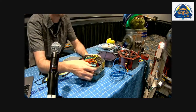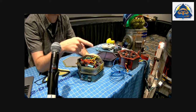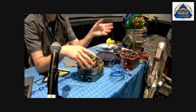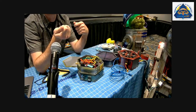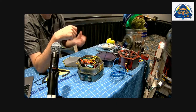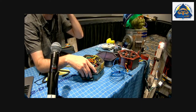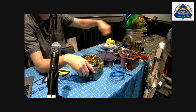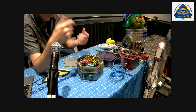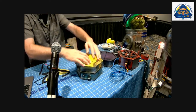And so something else I want to add onto here is another XT60 that I can have a plug that is basically just a short for it. And then that will be on the positive line. And you could put this in your Droid, pull out the plug, and then put in an emergency stop switch, and then put that anywhere you want on your Droid. So you could have essentially like that emergency stop on the back of the SK in the Star Cruiser had like a button there. So you could plug that in and have it wired into your Droid, but then remove it as you want to take the stuff out. And so that's power.